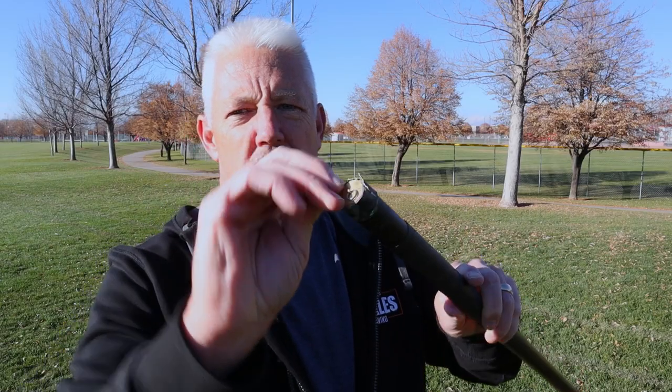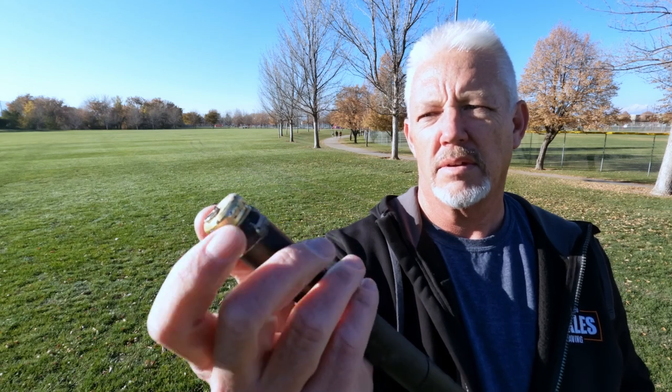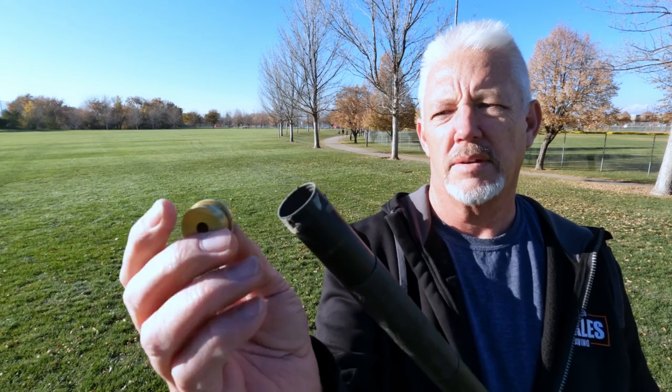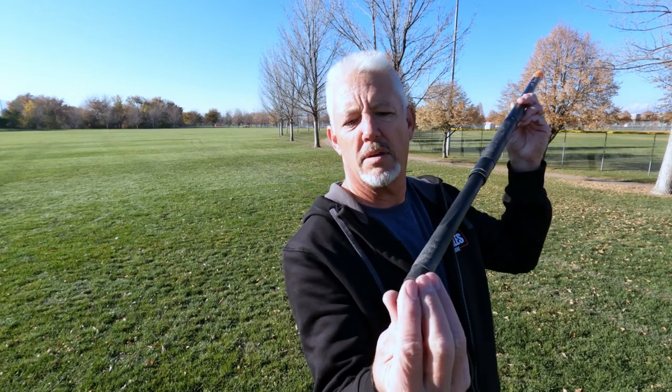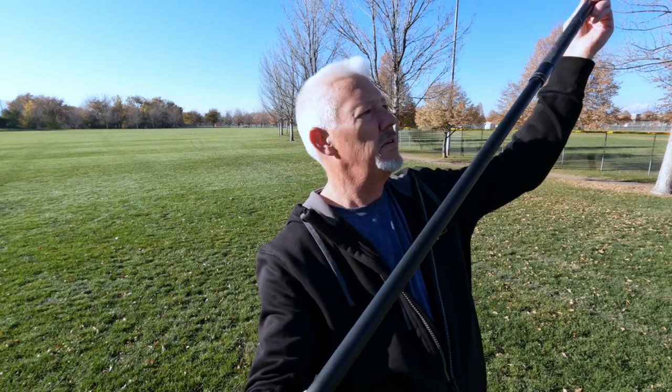Now here's another important tip for maintaining this rod, and you may need to do this. You use it out in the rain, the wind, the dust, the dirt. Stuff's going to get in there, and you need to fix that. So I take some duct tape and wrap it around this base so that it won't unscrew. And two, dirt's not going to get in here and damage the device, the cap that goes on here. The reason it's so important to take care of this cap is that when you take this cap off, you have access to all the sections. You can take them out and clean them, fix the order, or you may have a problem, which I've had a number of times, where one of these sections gets stuck inside the mast, and you need to take it all apart, clean it, and put it back together. And that's just part of operating.